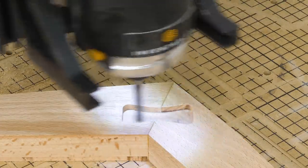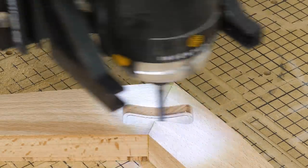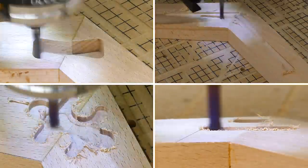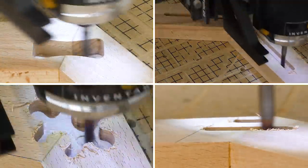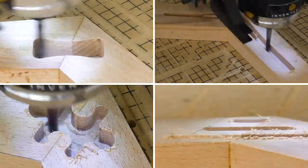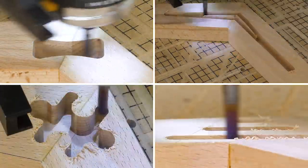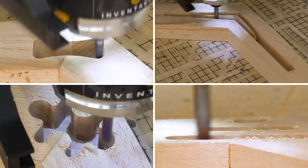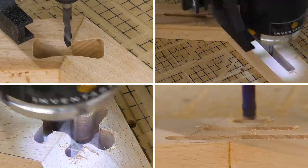Normally I probably wouldn't do four different cuts for something like this — I'd just pick one and repeat it — but since this was an experiment, I wanted to try a few different ideas. I ended up going with the aforementioned bowtie, a sort of spline look, a puzzle piece, and what I'm calling joint inception, which is basically a shrunken-down version of the entire leg. I thought about leaving an even smaller repeat of the same shape in the middle of the epoxy, but it was just getting too small to really see the shape repeating, so I abandoned that idea. One thing I took away from this project was that I probably don't experiment as much as I'd like with my CNC, so it was fun to mess around on this project. For anybody interested in getting into digital fabrication, I'll leave a link to the X-Carve in the description.